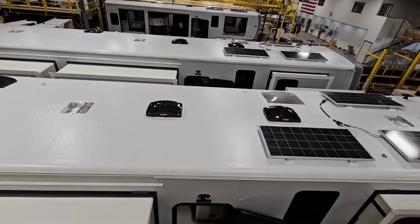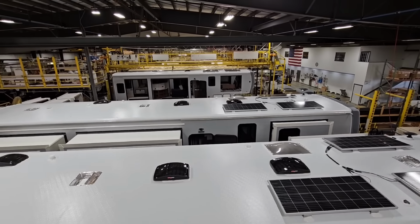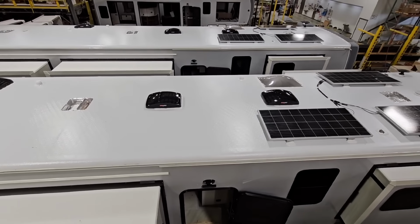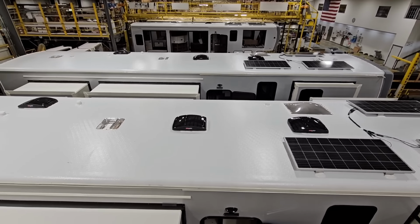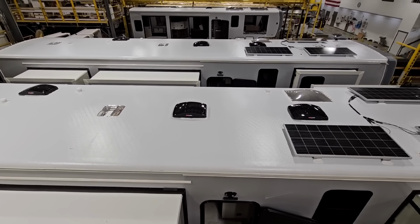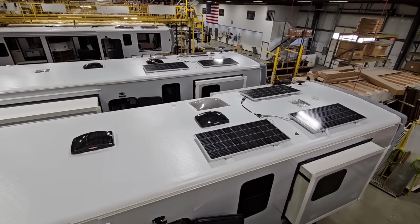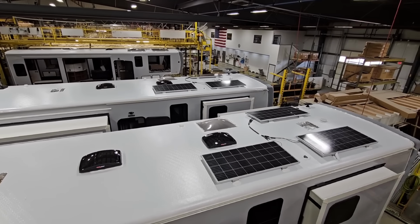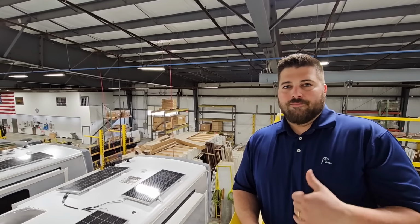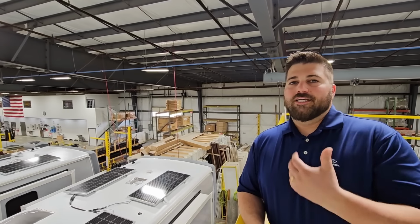So normally you would have a fan lid that opens up underneath that big, giant, oversized cover. So they're the slimline ones. We're also doing them in every bathroom, half bath, and in the kitchen of every unit. So in any floor plan, the microwave is on an exterior wall and does actually vent through the wall to the exterior, but we've gone ahead and added a Max Air fan as well. For that customer, cooking with LP stoves creates more humidity. LP heat creates more humidity. For the customer that's going to be somewhere and they're cooking meals in it, boiling pasta, creating a lot of steam, a lot of condensation, we want a great way for them to be able to get that outside of the unit.